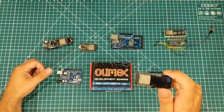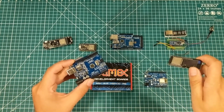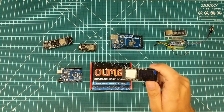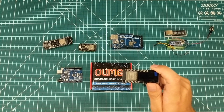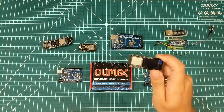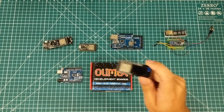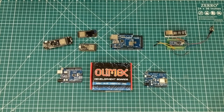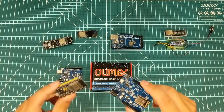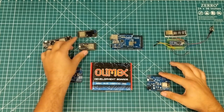These things are 160 megahertz. They have 512K of RAM — that might not mean much until you realize this Arduino has 2K of RAM. This has 16 megabytes of storage compared to 32 kilobytes. It has built-in Wi-Fi, built-in Bluetooth, built-in touch sensors, built-in CAN bus, 18 or 36 GPIO pins, digital analog converters — all kinds of fun stuff. That's why makers love them. They're really cool and really versatile.